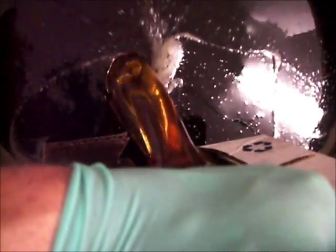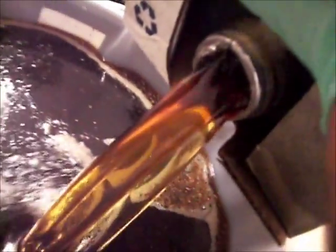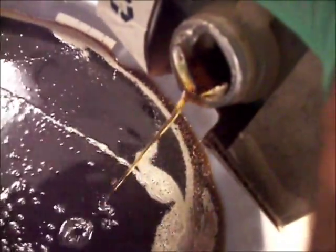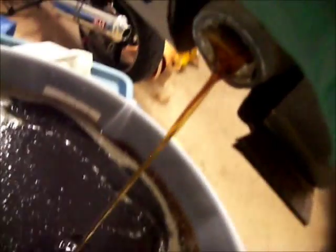All the mud and real nasty french fry stuff actually sits in the bottom of these containers. Once we get this empty you can see how clear it is — we've got some junk coming out. You can see the clear bottom; the rest of that is all this mud stuff, about a quarter inch of it. That's what you don't want to pour into your filter because it's going to really clog it.